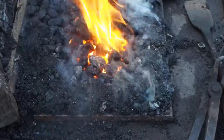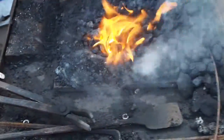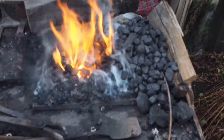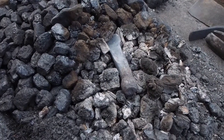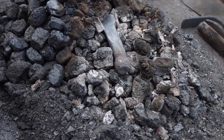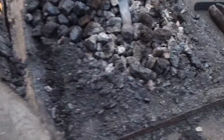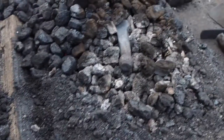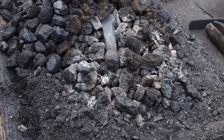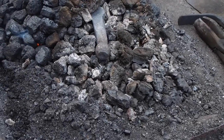I've spread some fines around the core of the fire to insulate and help it bake together, forming a nice fire nest. This is after the airblast has been turned off for one hour. Because this is green coal or bituminous coal, just turning the airblast back on will return you to an operable fire within a couple of seconds. It doesn't go out as easily as coke fires do, which would have been extinguished after an hour of no air. Green coal smoulders for a lot longer, so it's easier to restart the fire.